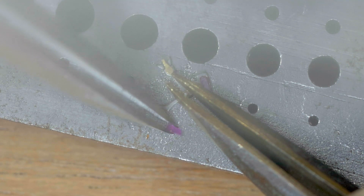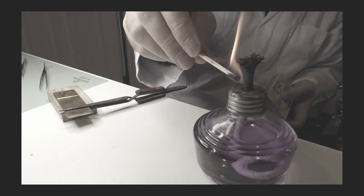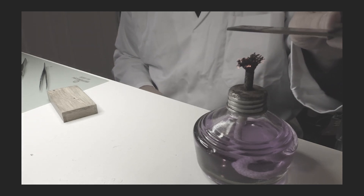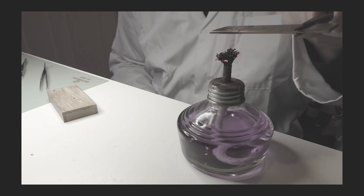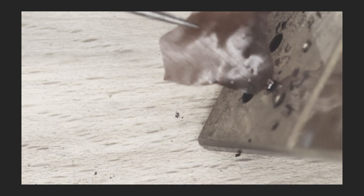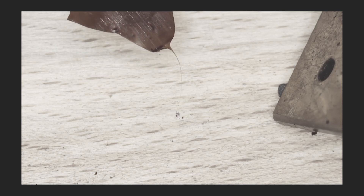Here's some footage of me using a basic handmade pallet warmer in a video I uploaded back in 2015. I need to heat my brass plate and for that I'm using a spirit lamp. It's not advisable to heat the item directly because it will get burnt, so what we do is we heat up the brass plate so that we can transfer that heat to the item — in this case a roller. And here's the shellac: what I'm doing is melting a little shellac and as I pull it away I'm creating a string.